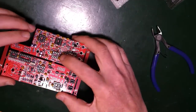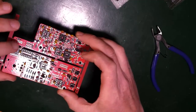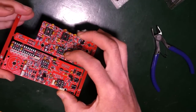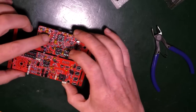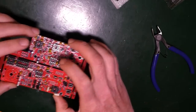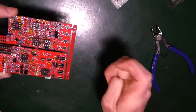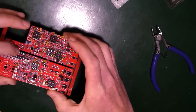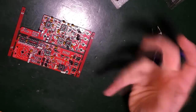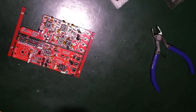What I've got to do is solder them. But because, as I say, all these capacitors are slightly tall in places, I should have put these in first. Oh, yes. So that's a thought. Maybe put those in before the capacitors and stuff. Because particularly these polyester ones, they really do stick out. So what's my plan at this point? How am I going to do this?